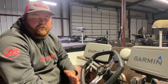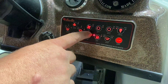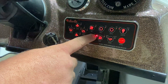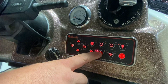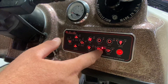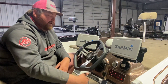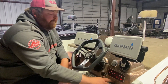This is the Cougar Hybrid — you have two fuel tanks, a port tank and a starboard tank, and it's always going to go to the left side. So if your left tank is empty and you're running the right tank, you go to the lake, turn your panel on, and automatically it goes to the left tank. If your switch is on the right tank, your gauge isn't going to be truthful to you. We always need to switch it over to whichever tank we're running. Vice versa — say you've been running the right tank practicing a couple of days, you hop in your boat, your left tank's full of gas, you see you're full of gas, but you're running down the lake and your four-stroke Mercury starts surging. You're out of gas — stop and switch the tanks. Always switch your fuel tank.